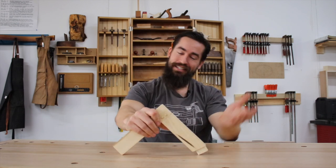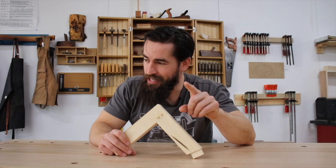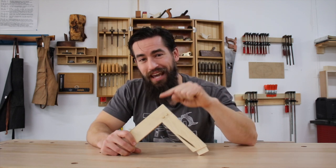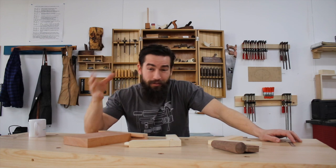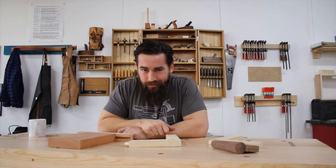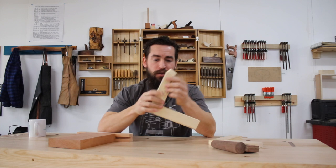However, with the dried timbers used in the furniture world and with contemporary adhesives, I'm going to submit a theory: that many mortise and tenons with a higher amount of glue surface is actually stronger than the mechanical advantage you get from a single large mortise and tenon. There's a thing called lignin — lignin is the natural adhesive in the fibers of the wood that holds those fibers together, like a bunch of straws held together by a natural adhesive.